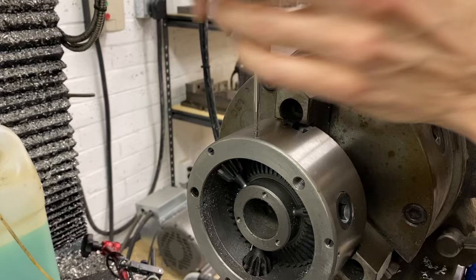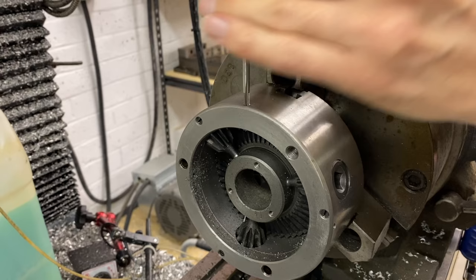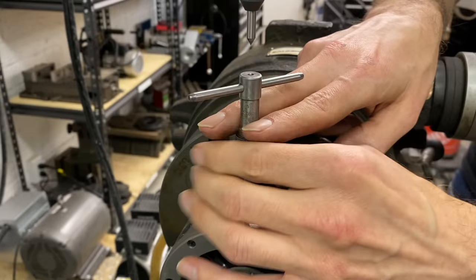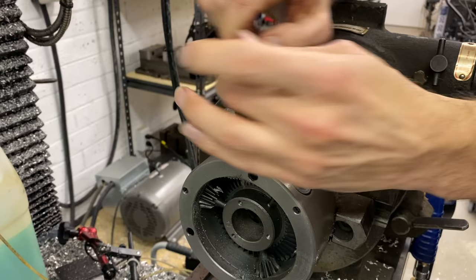The body of this chuck is thick enough — about 600 thousandths of cast iron. My only concern with doing this to a larger chuck is that with a large set screw you could put enough force on there to deform the chuck body, negating any benefits. For the set screws, I'd recommend alloy set screws — something hard that won't deform or wear out. Also get flat-tipped set screws, or just turn or grind the tips flat. Use a nice sharp fresh tap for cast iron — it'll work great dry, but a dull tap is going to give you a lot of trouble.